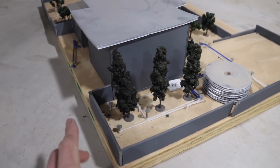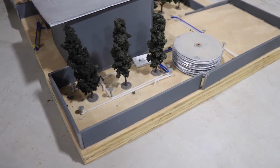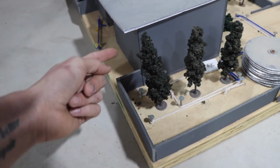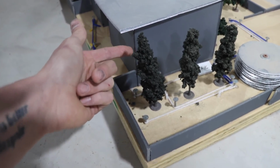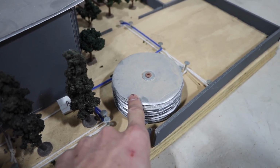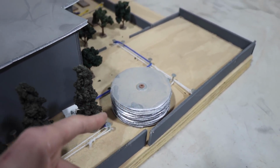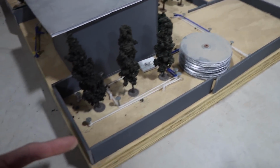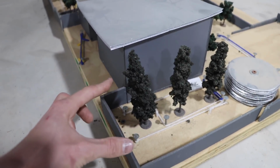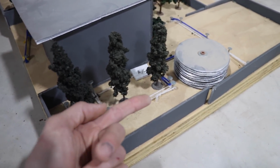If you remember that I made this 3D model, it can help us kind of lay out where we want some of our trenches for the things that we plan on putting in. So the current trench right now is kind of running this way right here, parallel to that front face of the building, or the back face. And I know that we're going to be putting our next Alchemate water tank, so it'll be 12,000 gallons, right at the front corner of the house here. So we can start to map out where that water tank is going to go, and then I can get our trenches underground because we're going to have the downspouts and the pipes underneath, obviously to fill the water tank going underground to it.